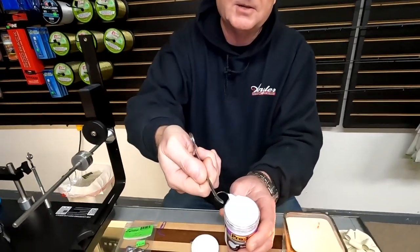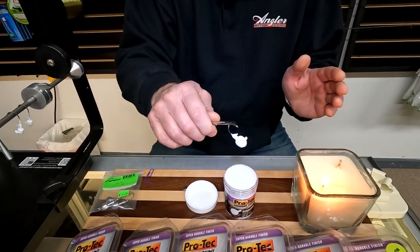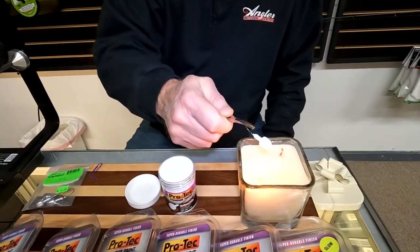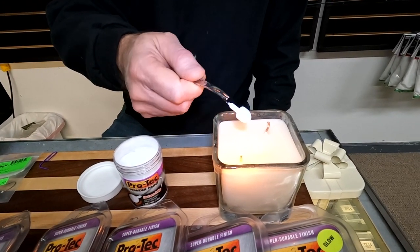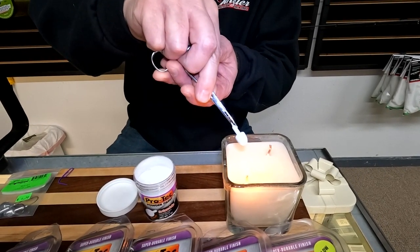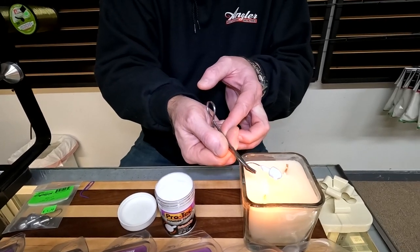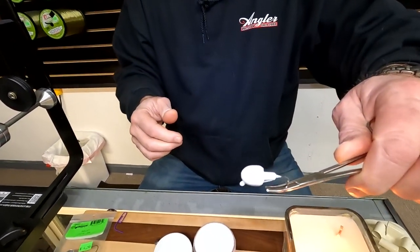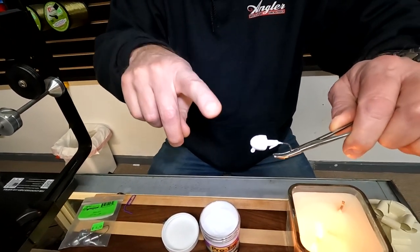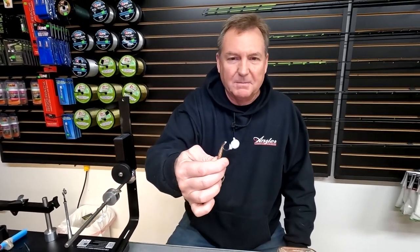You can see how that's starting to melt on there a little bit, but it's not nice and shiny. I didn't quite get the lead hot enough, but no problem at all — all you do is put it back over the heat and you're going to see it melt on there and turn nice and shiny. See how that's turning shiny and real pretty — beautiful. I did make a little mistake there: I can see a little bit of smoke coming off here, I got it a little too hot. So don't do that — that's why you should be in a well-ventilated area. You don't want smoke, you don't want to burn it. But that's not bad at all — I wouldn't call that burned, and that's perfect.